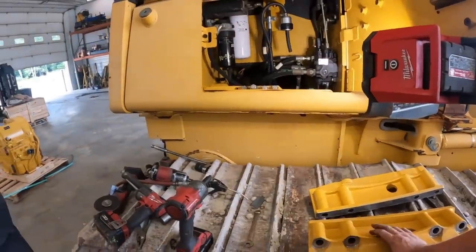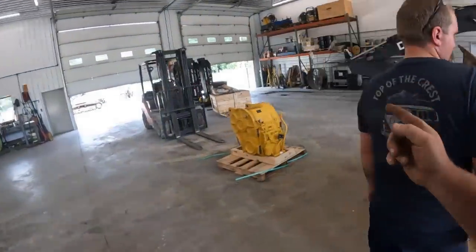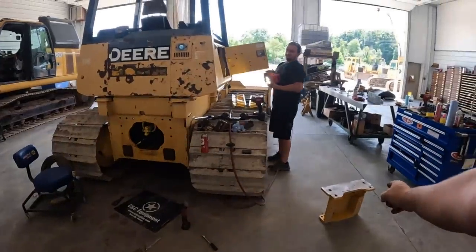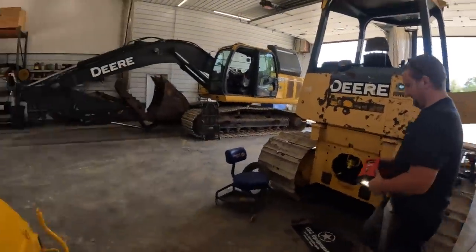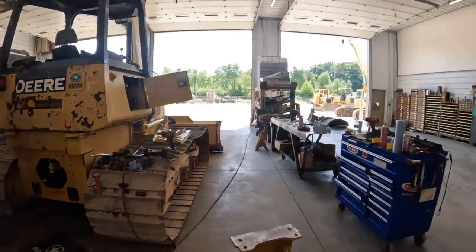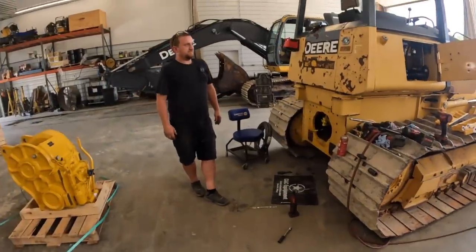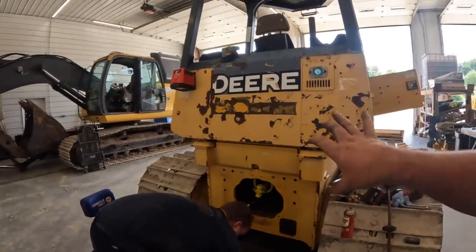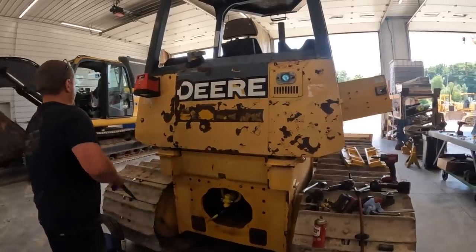We're gonna put these big mounts on the winch next. So we'll put the mounts on the winch, and then we gotta put this lower transmission pan saver on the tractor first, and then we actually gotta floss the winch down into that pan. The reason you can't put this all at once is there's some bolts that are hidden once the winch is in there. So it's kind of a pain to get on these smaller tractors. So we'll bolt that on. Kind of got to get the winch sitting at an angle so you can get in to put your U-joint caps and stuff on there, straps.